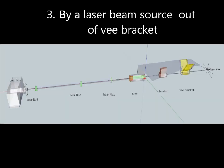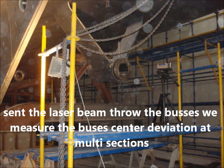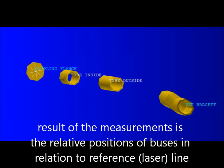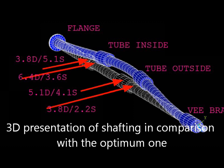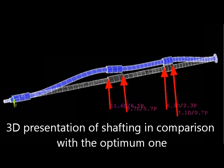We place a laser source outside of the shafting system and measure the bushing center deviation from the laser beam, taken as reference. The results of the measurement can be seen in 3D and zoom mode in the picture. Additional results from multi-session laser section deviation include the ovality of the bushing and a shaft bend test in situ if needed.